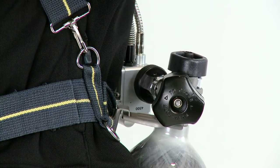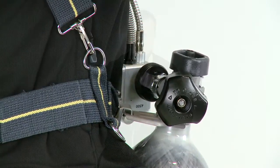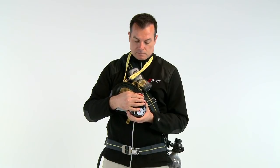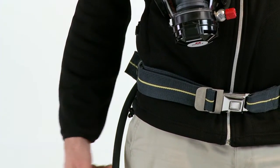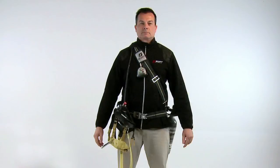Check to be certain that the hand coupling between the cylinder valve and the pressure reducer is tight, and that the breathing regulator purge valve — the red knob on the regulator — is closed or turned fully clockwise. Depress the air saver donning switch and release. Connect the supply hose to the airline connection hose on the respirator. There will be no flow of air from the facepiece at this time. You are now in standby condition with the respirator donned and in place, however not in use.